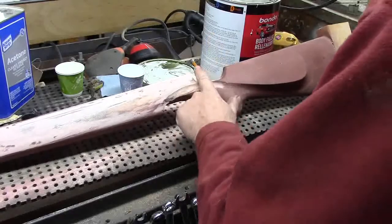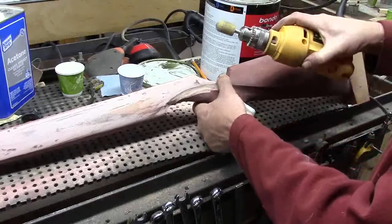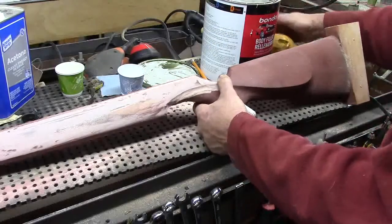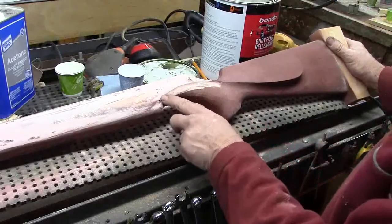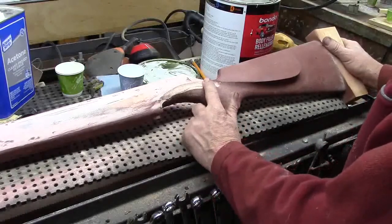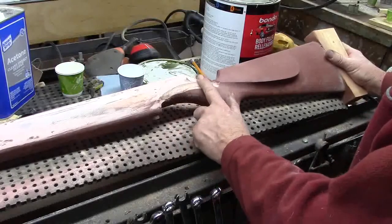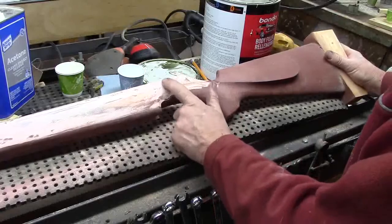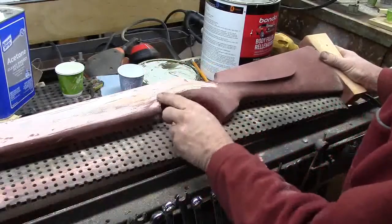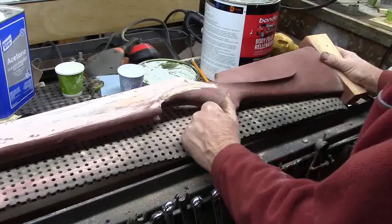What I did was knock off the bondo from my previous line that I didn't like. It needs a little bit more rounding. I used a three-quarter inch rounded nose saber bit from Chainsaw Sculptors to initially define where I want this to be — it's not quite really there yet, just a good start. Then I'm going to build up just a little hill of bondo right over the lip there. It'll give me something to shape fair and proud of the surface. Then I'll use a sheet of plexiglass aluminum with tape along the side to fill the whole side in to match that newly defined height. So here we go.